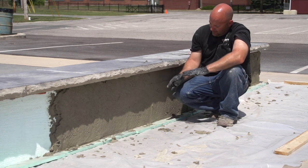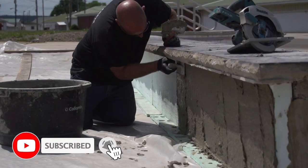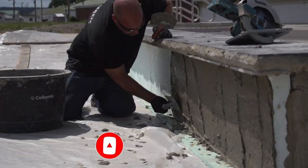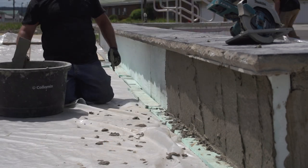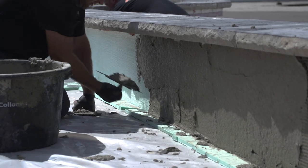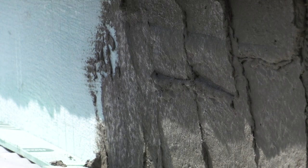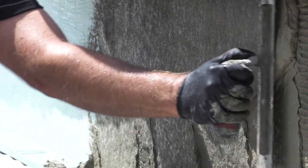Today we have a structure coat on here — a scratch coat for this foam. When I trowel it on there, it ends up being a little bit smoother than what I'd like it to be to then go back and put a veneer stone on it. For this application, we're actually going to trowel a vertical mix on here and then carve rocks in it, make it look really freaking cool. In order to do that, I want to be able to bond the next coat to this one.